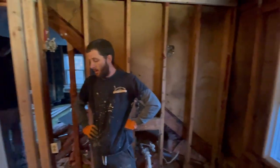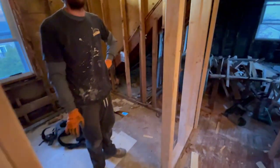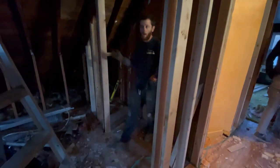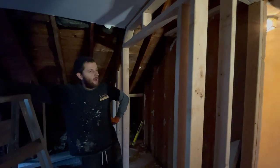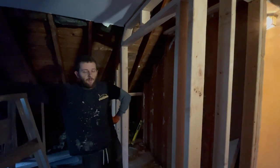We're wrapping up for today. We got most of the wall built and our ceiling rafters set. These cape cods are the biggest pain - framing them, dealing with all the angles, sheet rocking, spackling - they're the worst. This is my third cape cod house. We got this wall built, ceiling rafters done, this closet furred out and cleaned up. We still need to fur out one more wall, finish the back corner, and get our nailers in. Nothing in this house is straight or plumb, but we got our layout done which is the hardest part. Happy Saturday!